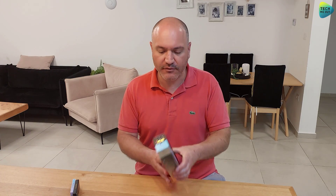What's the difference between these devices and regular USB coordinators? Every one of these devices has a 5 dB antenna and a 20 dB amplifier. So even if you chose to use them as USB coordinators, you will get coverage unmatched by any other USB coordinator, at least as far as I know.